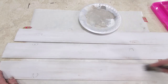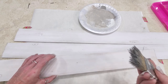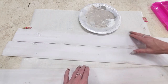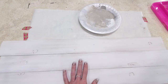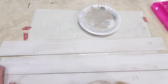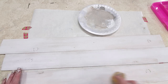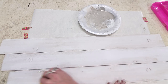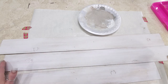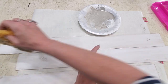You don't want to completely blur it out - you want a little bit of grainy grain and a little bit of softer grain. By mixing those it definitely makes your eye think it's seeing a lot of definition there. I just dragged this through without really adding much pigment, just dragging it across what was already on there - now it's got a few more lines. You can definitely leave some boards lighter, some boards slightly darker; it's not going to end up super dark just because this color mineral is not a super dark color.